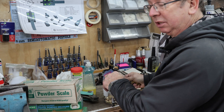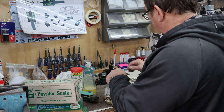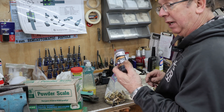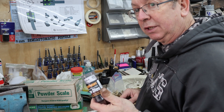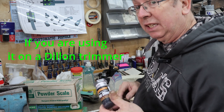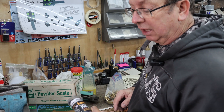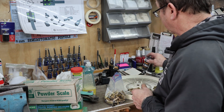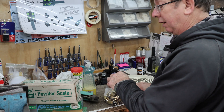This will evolve a little bit more — there are going to be some changes. I'll link in the description the stuff I'm using. There are some trade-offs that have to be considered. This Lyman die I'm running with my Dillon swager — Lyman builds a carbide die, fairly more expensive, but don't invest your money in that because they have to be modified and it's quite the hassle to modify a carbide die to the extent that would make it work. On a steel die, I did quite a bit of work — I worked the inside of it and the bottom side too, from both sides — there's lathe work and some polishing required. If you've got the capabilities to do that, they're going to work fine on a Dillon trimmer. Otherwise you're waiting on a Dillon die for your Dillon trimmer.